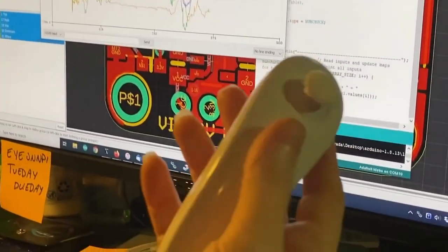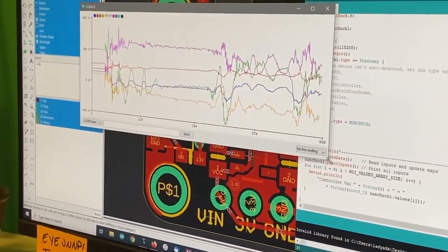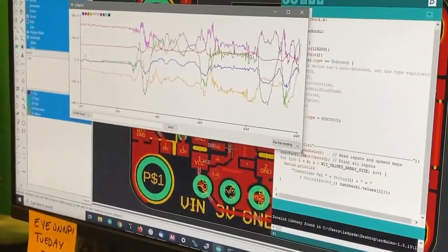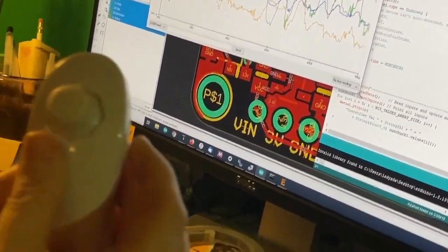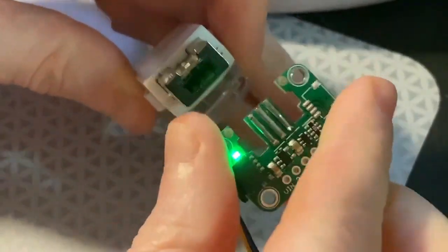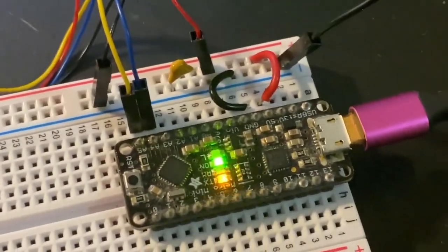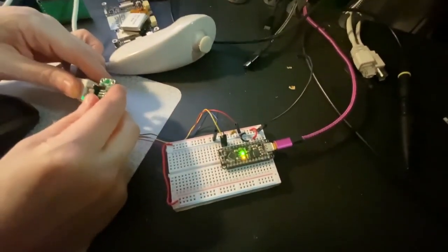I've got this Wii nunchuck here — kind of an old-school controller for Wiis that has an accelerometer, joystick, and some buttons. You can see I've got it plotting motion on the Arduino plotter. I'm testing out some new hardware based on old hardware — it's a little Stemma QT adapter with a PCB that the Wii Chuck plugs into. It's a cute little hack that slides into the connector. This is a level-shifted I2C that goes into a Metro Mini. We also have CircuitPython and Python code available, so you can take out those old Wii nunchucks and use them to control, say, your robotics.